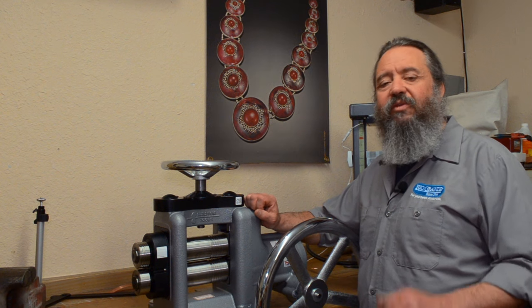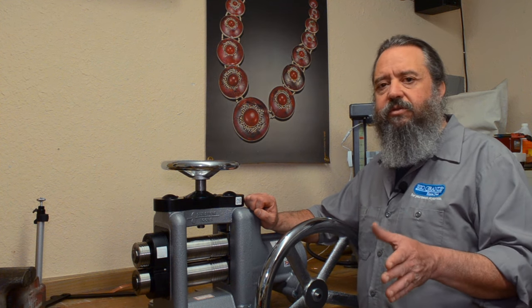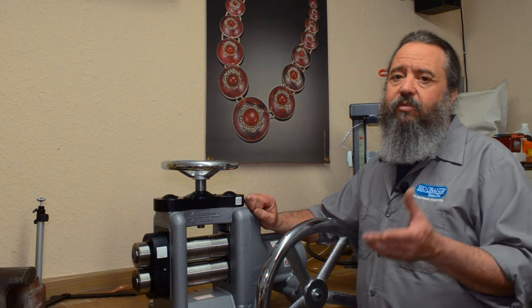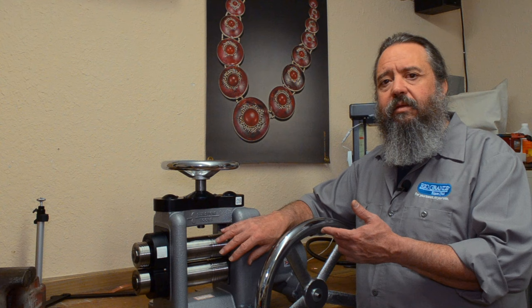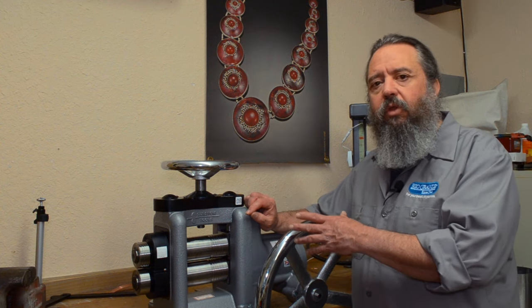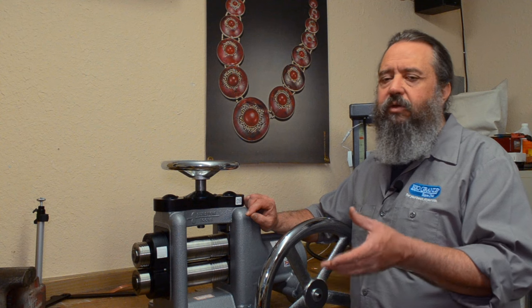Those were just a few examples of textures you could apply to metal using a rolling mill. I didn't give you step-by-step instructions for each one because there really is no hard and fast process — the material you're using for texture is going to require different pressures, and different rolling mills will react differently. This is where experimentation comes in. I always recommend starting with copper and brass, and using those until you become familiar with your rolling mill and the materials you're using. There are only a couple of rules: number one, don't use anything wet. Don't try to roll wet leaves through the mill — only use dry material. Anything wet or green will not provide a texture; it has to be dried out.